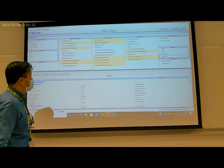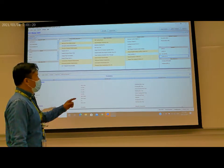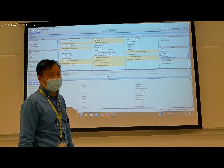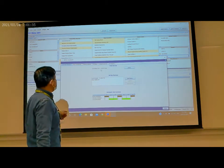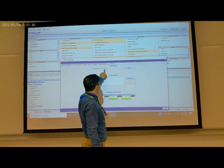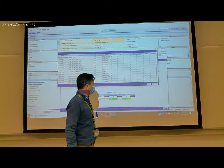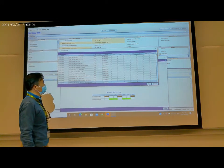So we have checked all input and output variables. Now we also need to check the controllers, the device, which is the defined hardware. Here you can see the controllers. It's not the one we are using. The one we are using is the FX-PCV 1832. Now it's 1630, so we need to select the one we are using. Drop down. So 18 here, and then okay.